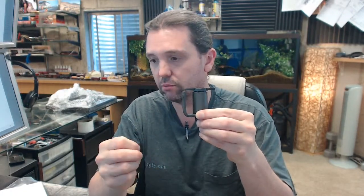What they're not giving you is the net door height. Based on a typical installation, what does it have to be? When I attach this to the frame, top and bottom pivot assembly, what should the net height be? Well, the answer is it's simply determined by the location of the bottom bracket, and the top bracket will of course be based on the height of the door. So you want to confirm that the height of the door will be compatible with the ultimate result for a door height. But if you're doing cafe sort of saloon doors, double acting saloon doors, they're typical height.